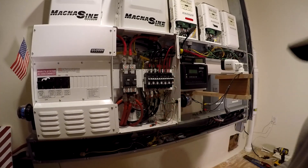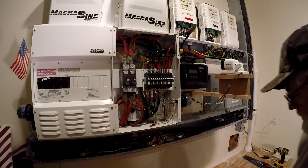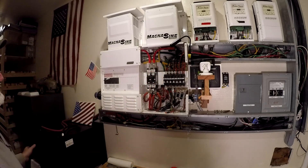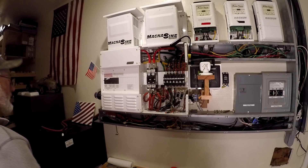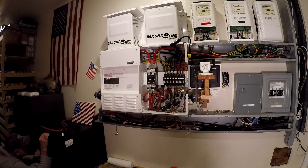Next, let's fire up the batteries. To start this system we're going to turn on both of the inverters — they're not on because the batteries are not. You turn these on first so it'll go through its charging process properly. It takes more than one battery to start these; these are the big heavy copper-wound transformers, low frequency inverters. I've got these switches on and I'm going to turn two or three of these batteries on at the same time.